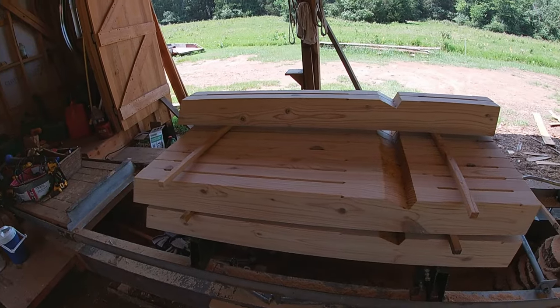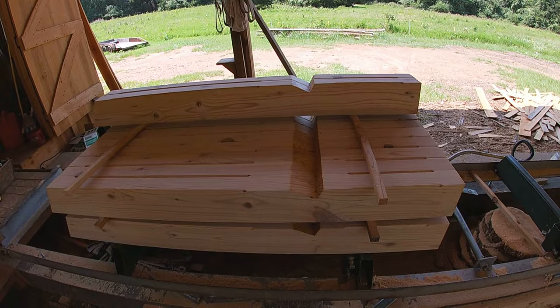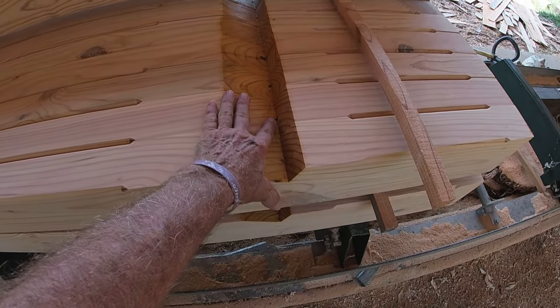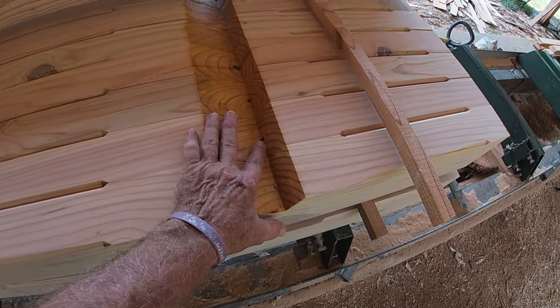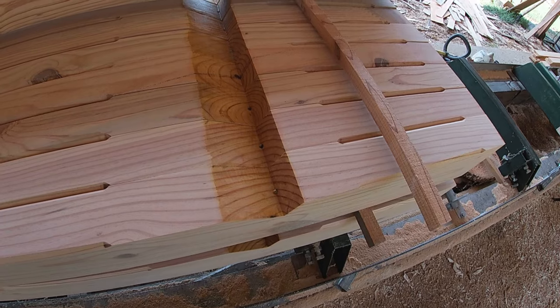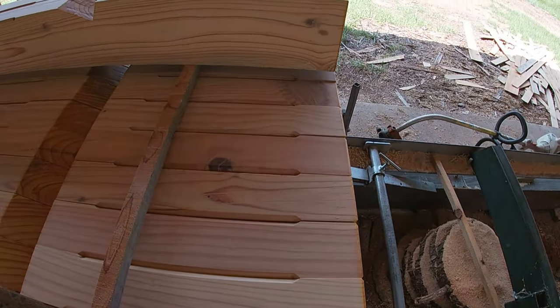I'm working the rafters out. I'm putting the chamfers on there that I want to do and the seat cuts, and I'm drilling a hole here to run a screw down through. I'll probably be using some of the log torque screws. They work really well. And I've done a little detail with the chamfers, and I'll show you what I'm doing on that.